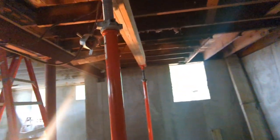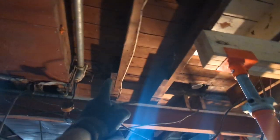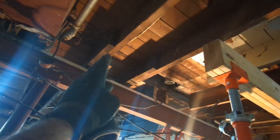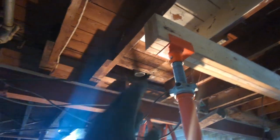Now I've got problems here because I've got an electrical penetration that I can't get around, so I clipped it off right there. And so I'll feed it out so I could be on our side here of this joist. I'd like to be on the same side of all of these if I can. And so the far side of the room, those joists are on our side of these joists. That's the ends of them that pass. And so if we go back to that layout with these sisters, it's probably a best practice instead of going to the far side of them. Then we've got joists at three different layouts in here rather than two different layouts by the side of the house. So that's my rationale on that.